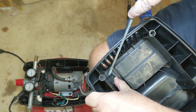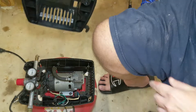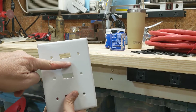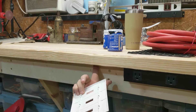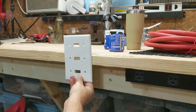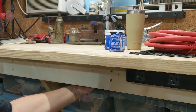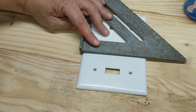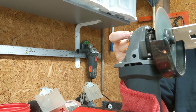Here I'm just trying to pop the switch out without stabbing myself. I'm going to cut the plate about right here and use this one piece, tucking it up to where it hits this lip — that'll be my cover plate. I can put the switch and the fuse in this plate and hog it out a little so the switch and fuse aren't touching anything. A single gang cover plate would have been easier, but I didn't have one, so I dug through my electrical junk drawer and found this one.